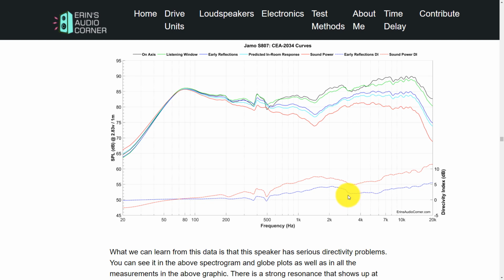So the tweeter would come into play at about 3000 hertz. It's omnidirectional. It's radiating in all axes. And then around, based on its size, around 7K or so, it starts to become directional as its radiation pattern trends from omnidirectional to forward facing. And that's okay that it's trending forward. That's not a big deal. The real issue here are these resonances and then this directivity mismatch.